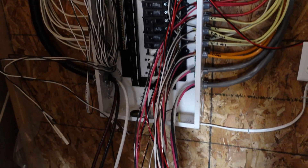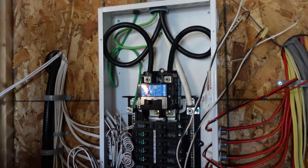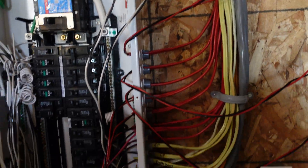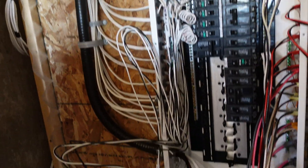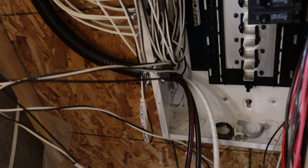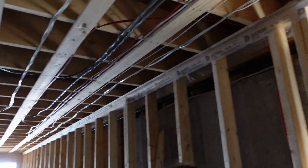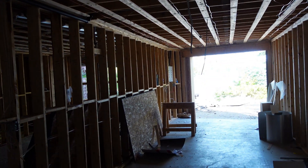So we'll go through it and show you how we've done it. Here's our main 200-amp panel coming in from outside, the street side, with our main 200-amp breaker at the top. You can notice all our branch circuits, with the exception of this one big black cable that's a 100-amp cable. At the bottom of the panel we have our neutral and our two hots, and that runs all the way along the wall to the sub panel.